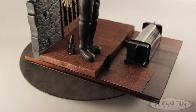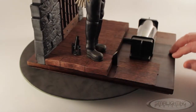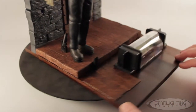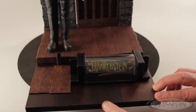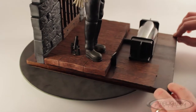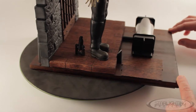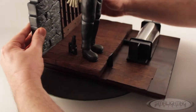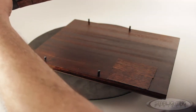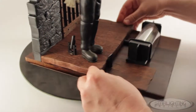I wanted to describe some additional features to the floor. I used a base wood plaque, stained the same as the floorboards on the kit — it came out a little bit darker but I like the contrast. That gave me a fair amount of extra space to put the animated nameplate that I created. I'll talk about that when we cover the electronics. I also wanted to make the base portable for shows, so I put four pins to locate the model base, making it really easy to take the model on and off.